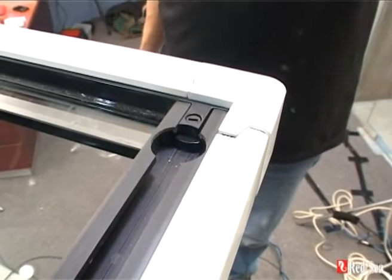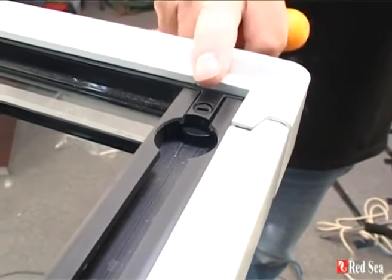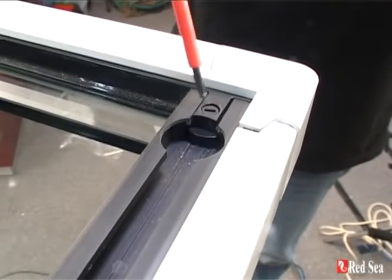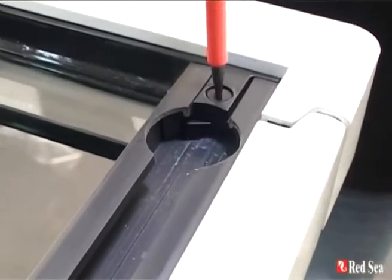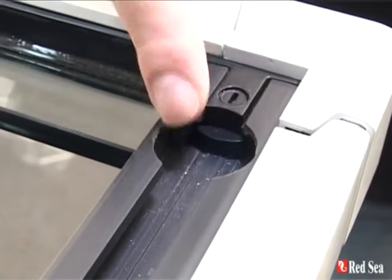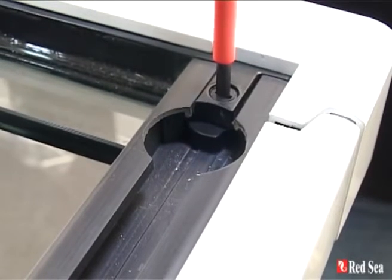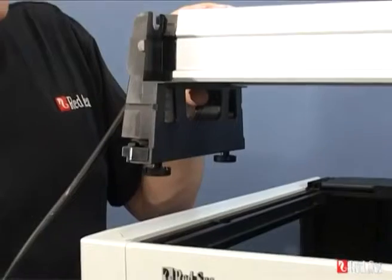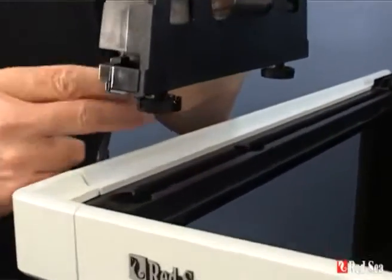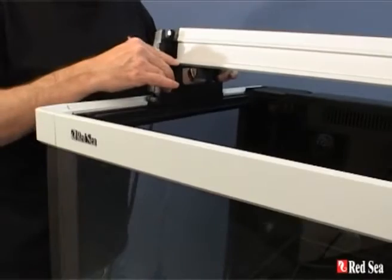Okay, we're about to put the chassis with the center unit onto the aquarium. However, we have a locking mechanism to make sure that the complete unit cannot be removed inadvertently. These locks are at the front of this rail here, and by closing it we prevent the unit going in and out. So the first thing we have to do on both sides, left and right, is to open these locks. Raise the chassis above the aquarium so that the legs are above the holes in the rail. Drop it down into position on both sides and slide to the center of the aquarium.